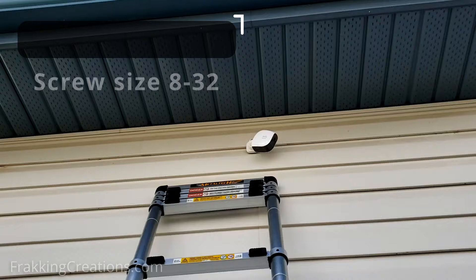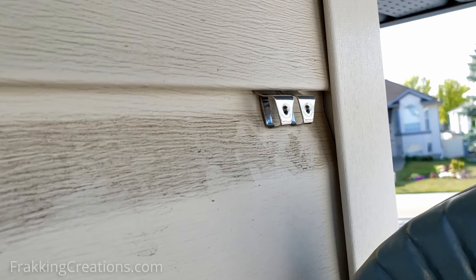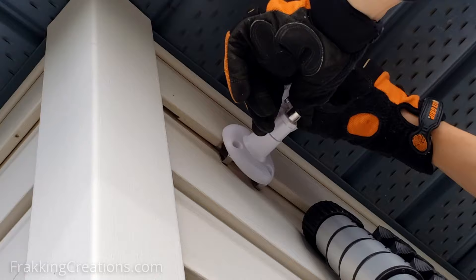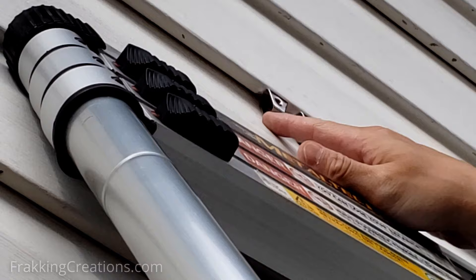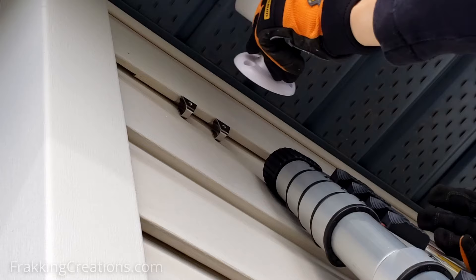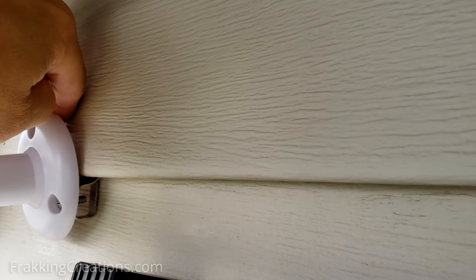Installing security cameras and motion sensors. When used to install security cameras or motion sensors, you will likely use two or more hangers since most mounts use three mounting screws and only two will line up at once. If you use our hack to make these hangers hold more weight, then two screws should be enough to hold the cameras up. Find out how to do the hack later in this video. For our installation, we used two hangers because these Eufy mounts only use two screws, and for the motion sensor mount, only two will line up at a time. For three-screw mounts, attach to the hangers using the bottom two holes. The reason is that you can use a screw and nut to fill the top hole for a more secure hold.